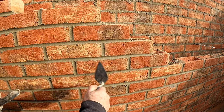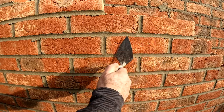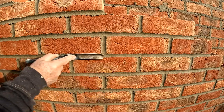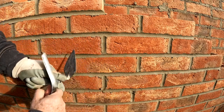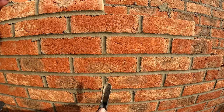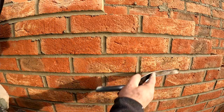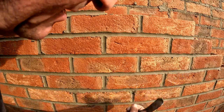I think someone took a bit of care about it. Often people have paid a lot of money to have this sort of work done. So I'll scrape the bricks out, take the bits off, and get that back on there. Starting to come up. What I'll actually do tomorrow is go over it with that brush I showed you earlier - that'll pull any real excess and flaky bits off, but it won't damage the finish of the mortar. Starting to take shape.